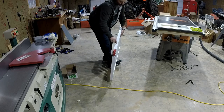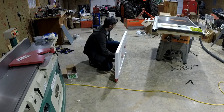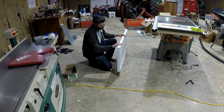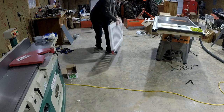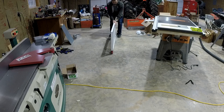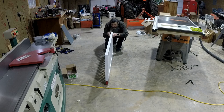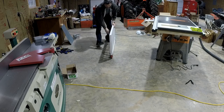To catch up on what I've done: glued the bottom cap on, then glued the top cap on in the same manner. I used appliance epoxy paint - just white Rust-Oleum paint - after priming, then put the casters on. The next thing is to track the casters. Since this is going to be a sliding baby gate and it only needs to roll about 40 inches, you just pick a point to sight down, roll it keeping it as straight up and down as possible, then check again. This is tracking just fine - no adjustment needed.